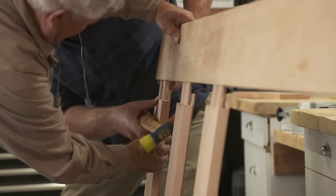If you put pieces of wood together and you have a joint that has a very hairline crack in it like that, a small joint, you can fill that joint with some glue. Force it in with your finger and wipe off the excess. Now you're going to take the sander that you have, disconnect the hose because you don't want suction. You're going to hold your finger over the hole while the sander's on, and that will force the dust down into the glue. There you go, an invisible joint. You're a magician, Tommy.